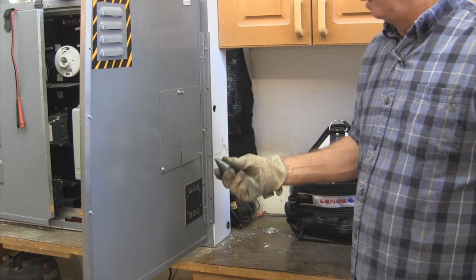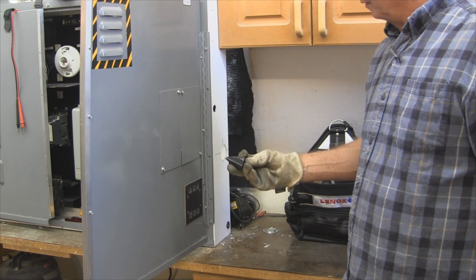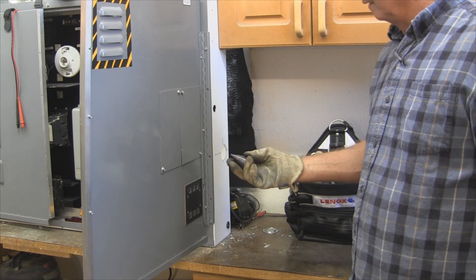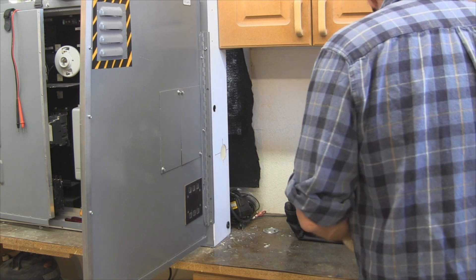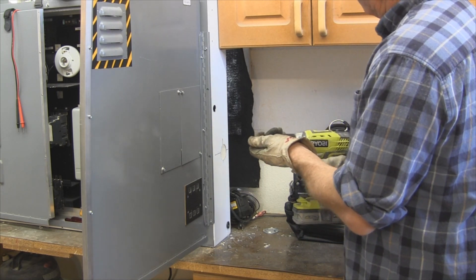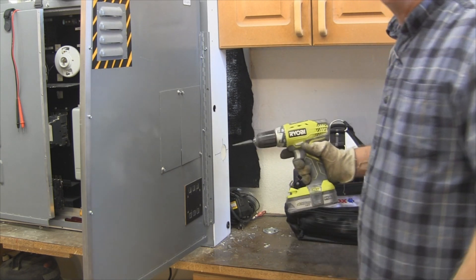The other unibit here goes half-inch through one inch, and this can be a beast, so I don't use it that often. I'd go for a hole saw or a knockout first. So that was the seven-eighths. What I'm going to do now, instead of breaking out my drill bits, I'm going to drill a hole with the seven-eighths unibit.